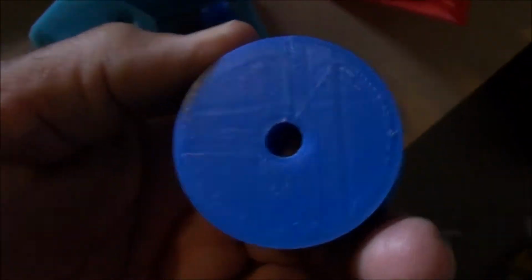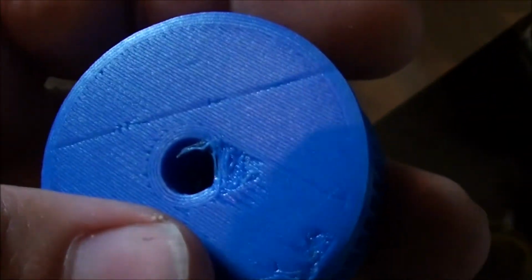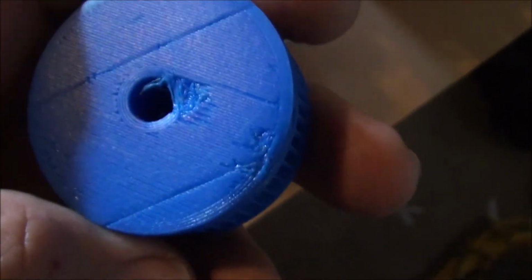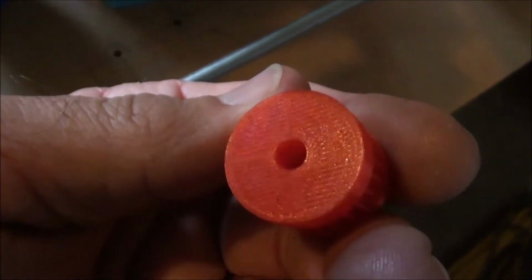And you can see, not real good quality on the bottom there. So you just need to get your printer set up really good, and that's your height off your bed, and make sure the bed is clean. I always put new masking tape down after each print. Otherwise you get those little imperfections there because the previous print might have left some material or put a bubble in the masking tape when you've lifted it off. So if you have a look at that one, this is one I did recently. You can see there it's a pretty good finish. That's the bottom finish there.